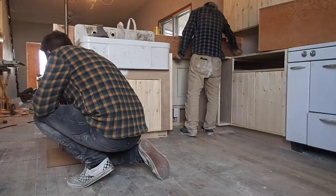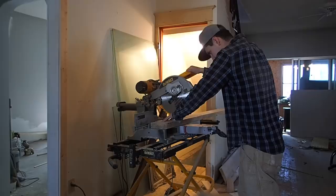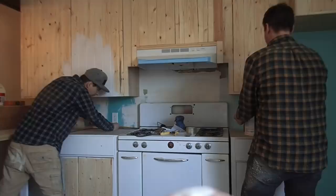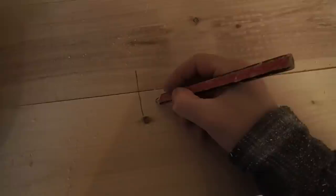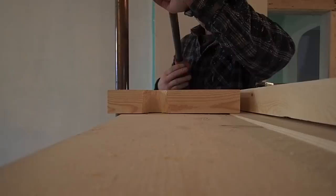For this kitchen we were doing a wood countertop — a farm style build — except near the range. I measured out a spot matching the right side of the range where we'd use a different non-combustible material to pass code. The range sits a little too high for a combustible countertop, so we went with concrete there. Building the countertop around the exposed copper pipe was tricky but important to keep that industrial artistic element.